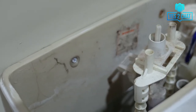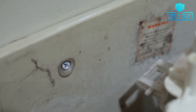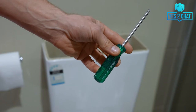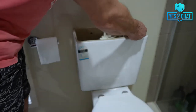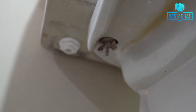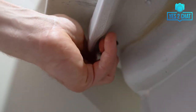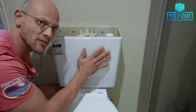As I mentioned, my toilet is actually fixed to the wall with a couple of screws which I will have to remove to be able to remove the cistern from the toilet pan. I'm going to use the Phillips screwdriver to undo these two screws. Once the screws are removed, look at the bottom of the cistern for the wing nuts, which we will have to remove as well — on both sides. And now we can remove the cistern from the toilet pan.